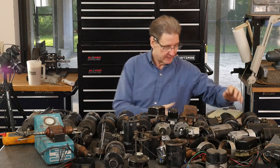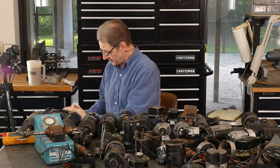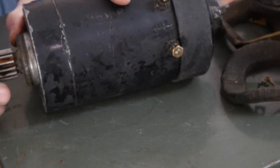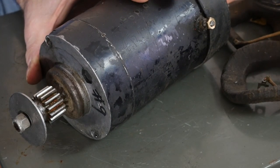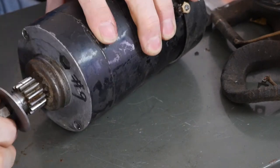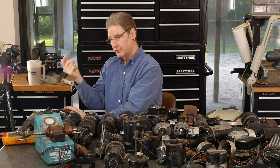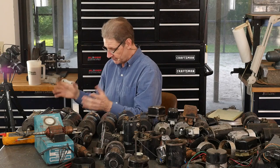Then, as I said, 65, let's bring that 65 generator back. I should mention, even from the 58, they changed the, 60, for the Sportster, they kind of went to this type of gear. Let's get this in here so you can see. This type of gear, a flat washer, and then they use a prevailing torque nut, which I hate. I tend to put a lock washer and no Loctite, just a lock washer, but lock washers wear out, as I explained, working for that military contractor I learned. Use a lock washer once, throw it away. Get a brand new lock washer. They're a dime a dozen at Home Depot. New lock washer. So I do that.